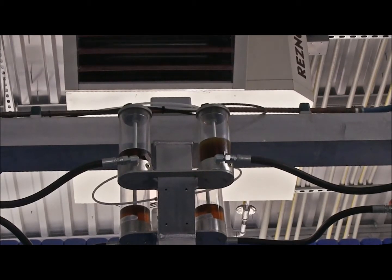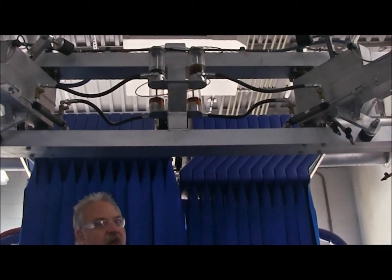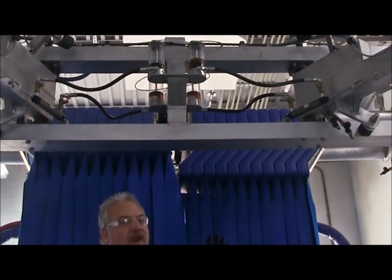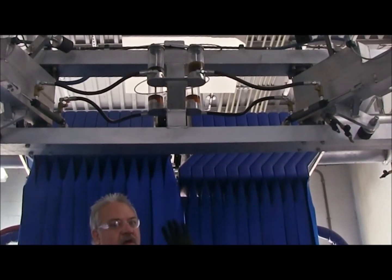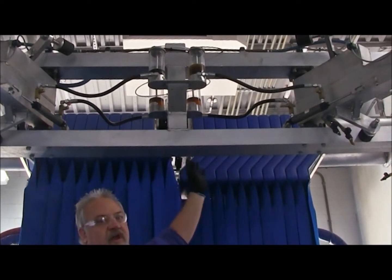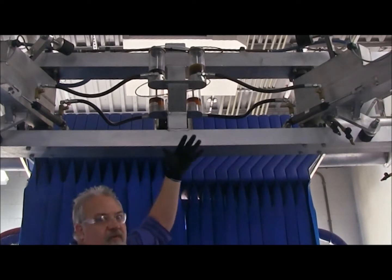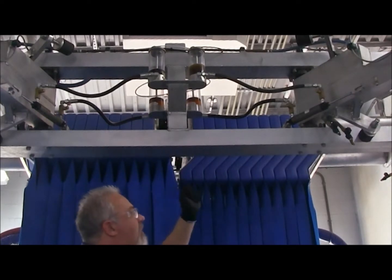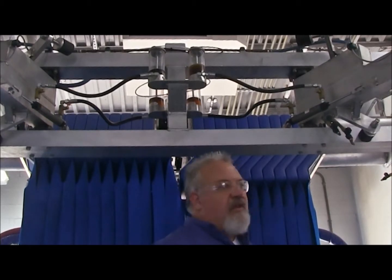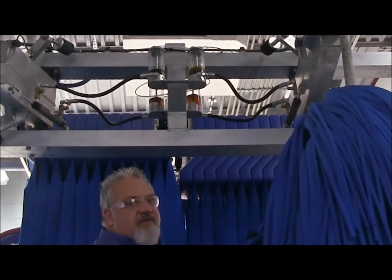In addition to that, something I rarely do is I'm going to be quiet in this area. What I'm listening for is an air leak. I want to make sure that I don't hear an air leak up in this area. There could be an air leak going in those from the airlines, going into the air over oil canisters. There could be an air leak because there's something going on with the cylinder that makes that brush go in and out. So give a good listen.